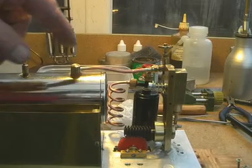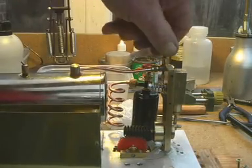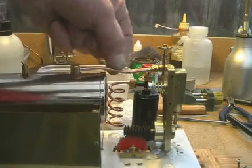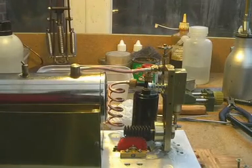Another priority is here — from the steam outlet from the boiler to the regulator going into the cylinder, we need a steam oiler there, without any shadow of doubt. We've always got to have one of those. There's just enough space. It'll just fit nicely there, but we've got to make one first.